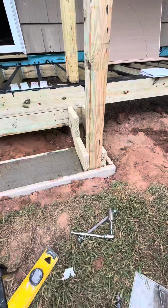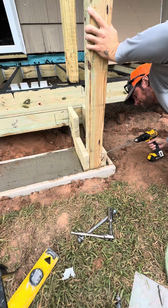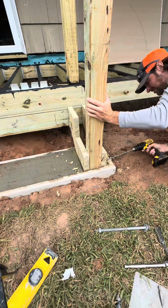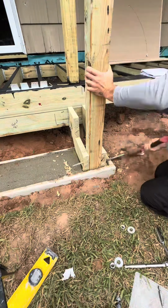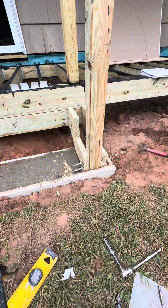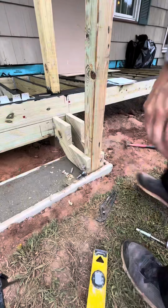Now we do these 12 inches apart, but we do way more. We stack the corners to lock in our post that will catch our eventual rail. We quickly screw them in with a lag, but then we drill 2 holes for 1/2-inch bolts, and we're going to bolt. We use 10-inch bolts, and we put our washers and our nuts on. Then we cut some of it off so that we can fasten it all the way home with our socket.